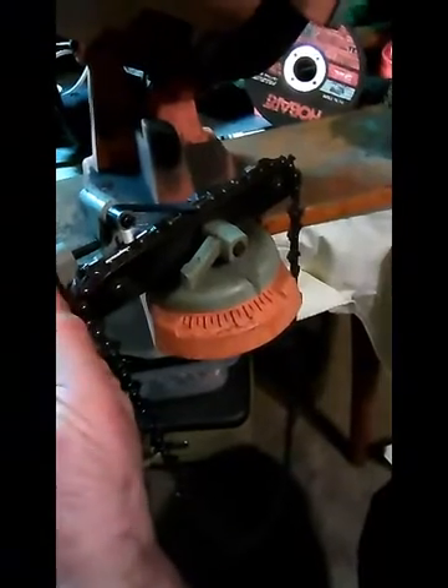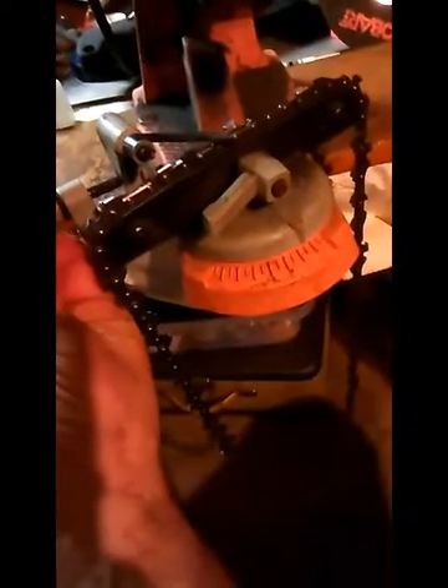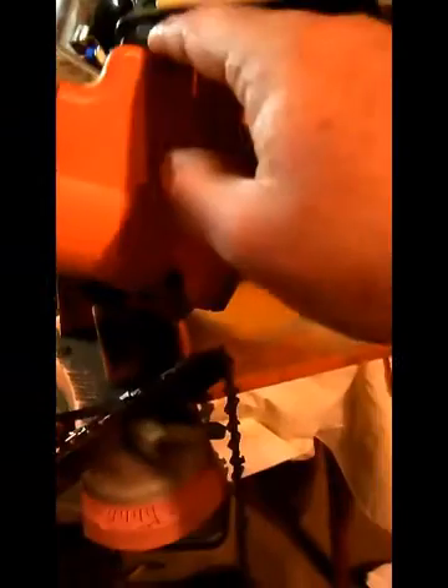So all the sparks were coming off the radius of the wheel, which means it was grinding down in the radius of the tooth but not up on the cutting edge. So we're going to loosen the vise, back this knob up just until there's a gap, then run the whole thing forward just a hair, make sure we're back against the stop, lock it back down, and try again. When you're pulling on this — on these plastic ones — you can flex it back and forth, so you want just light pressure, two fingers is all you need. It pulls at an angle, so you want to follow that angle. You don't want to be pulling down like this because you'll change how it grinds. A better grinder, you wouldn't have these problems.